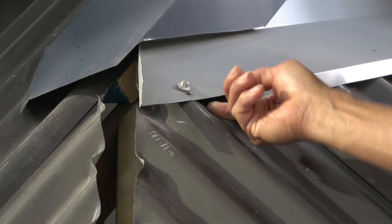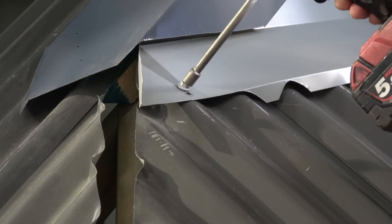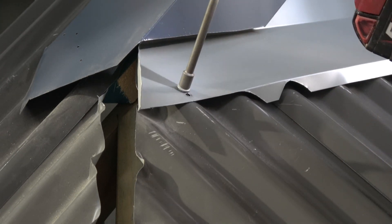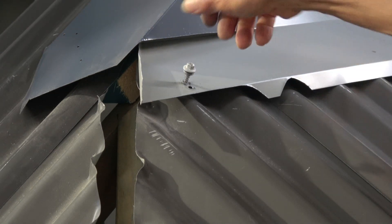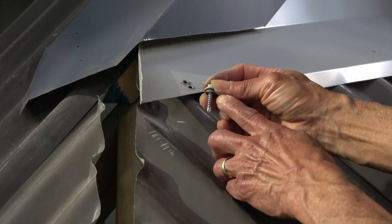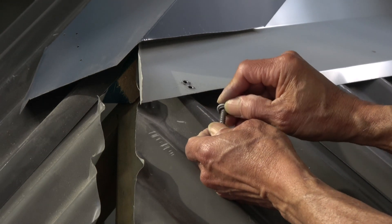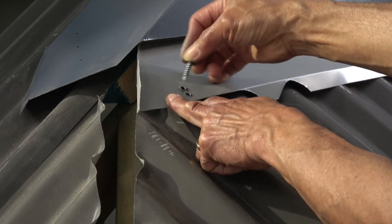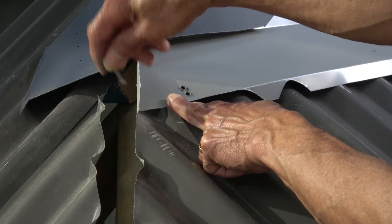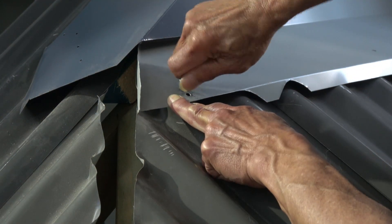This is solid because the screw has got a full thread. It hasn't got an enlarged shank. The thread goes all the way up to the washer, and that binds two pieces together without needing a batten underneath to hold it all together.